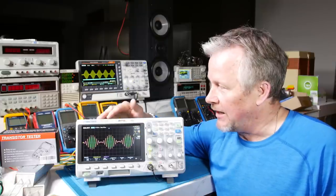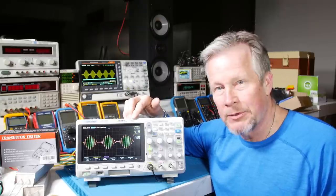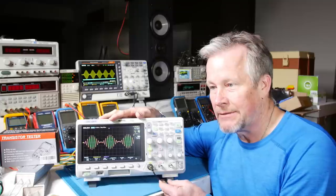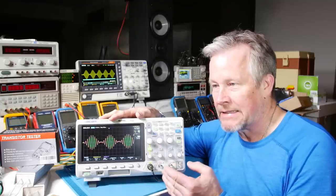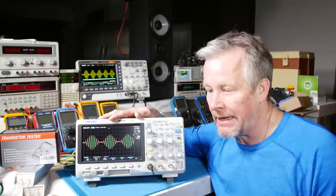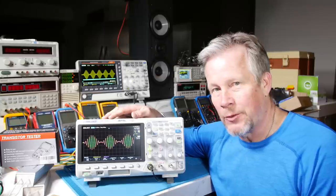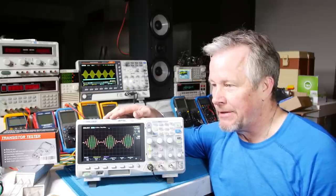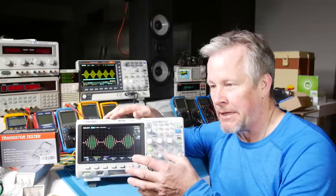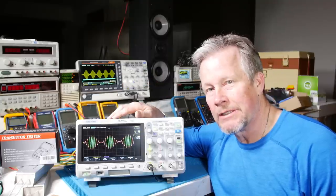Now the digital bandwidth — that's very important with a digital scope. It's the samples per second: how many times it's sampling that waveform when it comes in and gets converted from analog to digital. That's how many measurements you take from that waveform. Nyquist solved that problem — he came up with the theorem that says if you have two points in a cycle, with his mathematical formula you can regenerate that waveform. So the theory is two points per cycle.